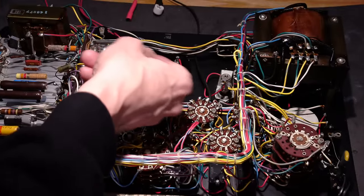We have four adjustments for the alignment procedure — VR on the back, and one here, one here, and one here. That is the entire alignment procedure. This is a four-wire meter with a bridge rectifier inside, which makes it a special meter — not something you can find everywhere. You want to be very careful not to damage it; it's put together somewhat like a watch, and if you bump the wrong thing you can completely destroy the meter. They are repairable though.